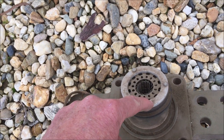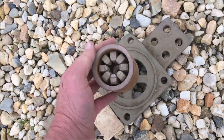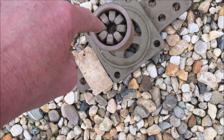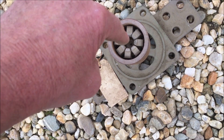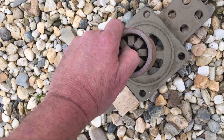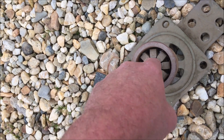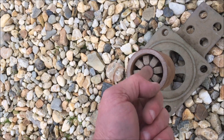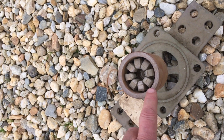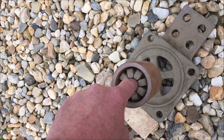That's in the centre of the breaker. At the top of the breaker you'll have something similar to this — again, this is not out of that big gas breaker. The top of the moving contact gets jammed down in there and they're spring-loaded; there's a lot of tension on them, so when it pushes in it's really tight and making really good electrical contact. If it didn't have the spring tension, it'd be flat out carrying 50 amps. Because of that spring tension, it's good for 3,000.